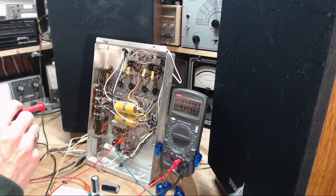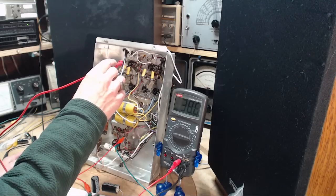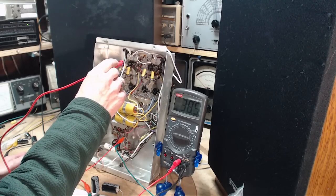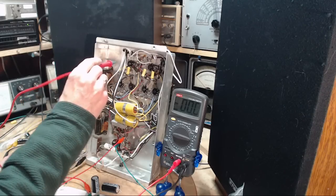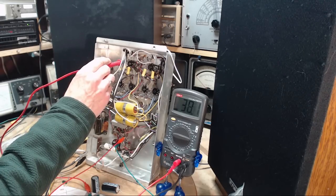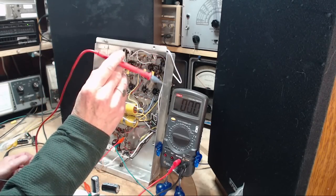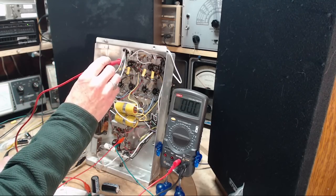So we'll start. We'll just go pin 1, back and forth and watch what happens here. Pin 1, 38. So that's the voltage that we're looking for, in fact, isn't it, on the grid? Pin 1 is the plate of one side or the grid of the other in here. Oh, careful there. You can actually see the wire going across to the grid. So 38, a little high. We're over here now. Hey, the hum came up, 19. Look at that. So something is going on here. Something is going on already. We're zeroing in on it.